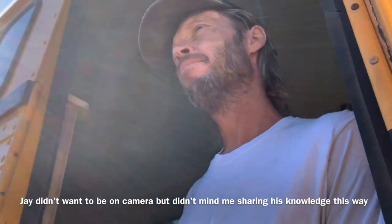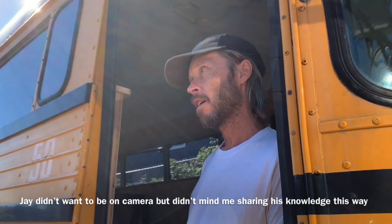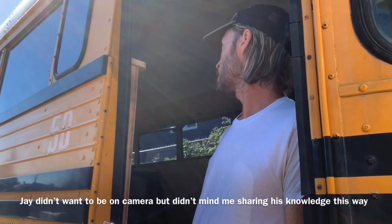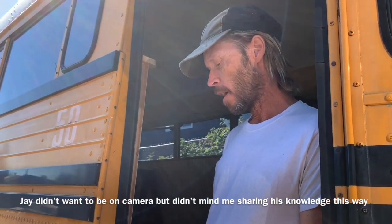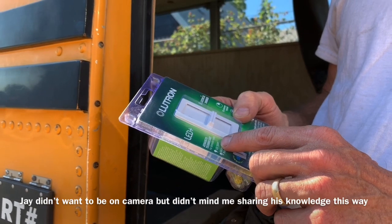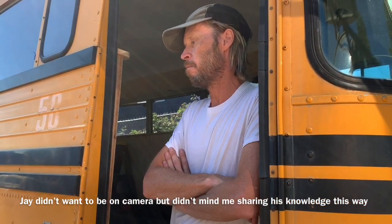Power is wattage - that's the fourth element. In my case, I'm putting one circuit together - a 15-amp circuit is what I was thinking. I got 18 little hockey puck LED lights at seven watts apiece - it says max seven on them, which is the maximum they'll ever draw. I also got a dimmer approved for LED that says 150 watts. Seven times 18 is 126 watts, so I'm under the 150-watt maximum there, which is perfect. And I'm wiring them in parallel.